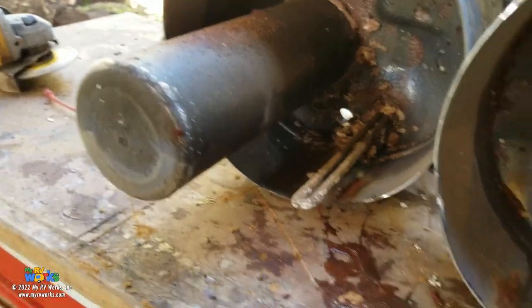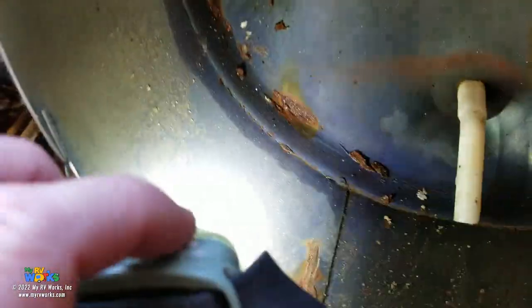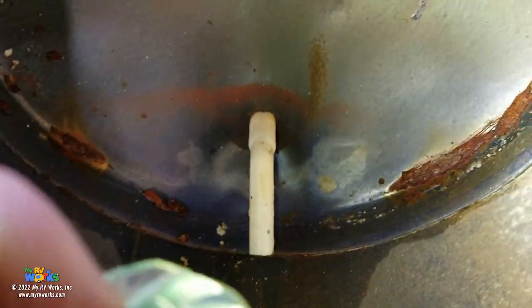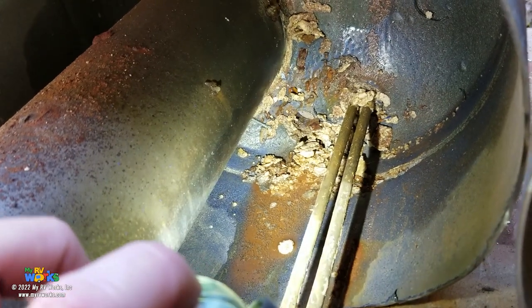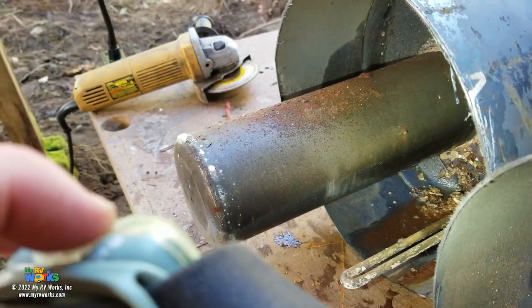and I'm sure we're going to find the same thing. But I guess the takeaway, I'll turn my flashlight back on, is one of these points here was rusting. All it takes is one, and you have a rusted through tank. Okay, now this was a smaller 6-gallon, but all it takes is one spot, and it'll weep, weep, weep, drip, drip, drip. Okay, so now what I'm going to do is I'm going to cut this guy, cut that open, and just see what's in with that.